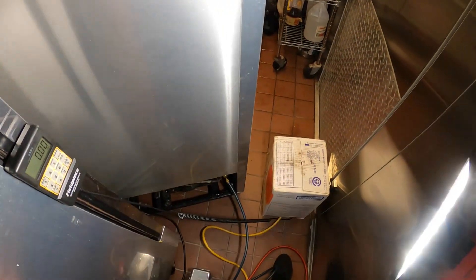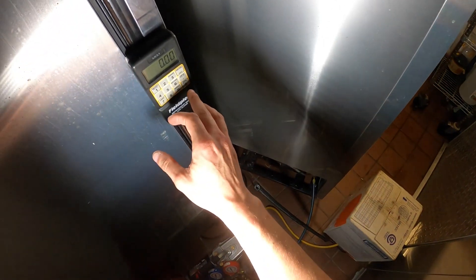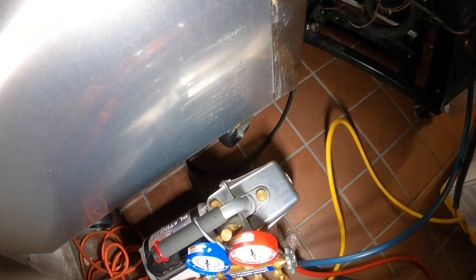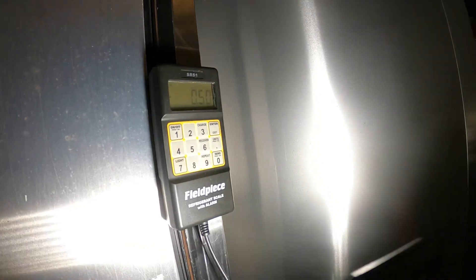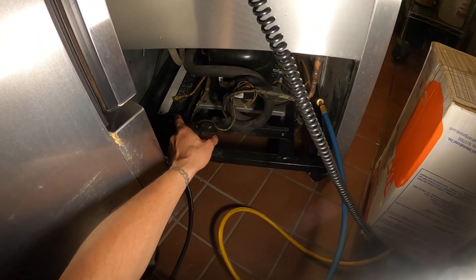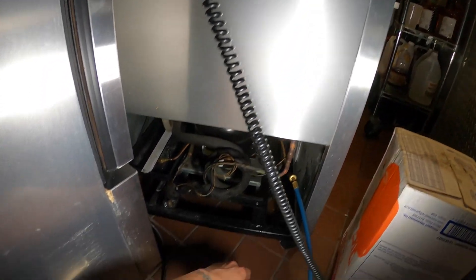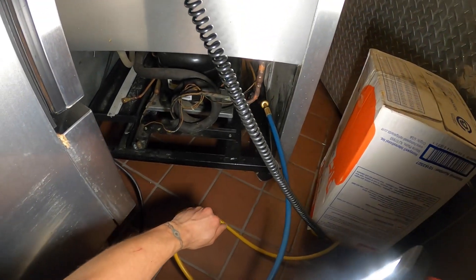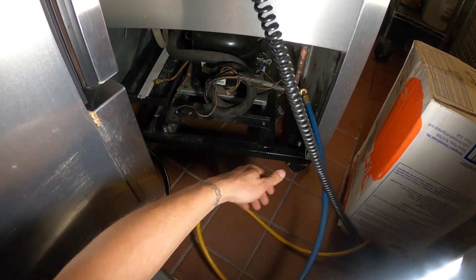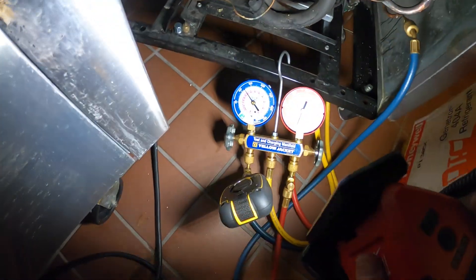We're at 751 microns. We're going to close this and make sure the vacuum holds, and from there we're going to charge up this system. We're done with the vacuum — everything looking pretty decent. This is refrigerant 404A. I looked at the unit tag and it takes 10 ounces — this is a critical charge. I already purged the air out of the hoses. On the blue hose I'm going to open it up and watch the ounces. You need 10 ounces, but I brazed in two ports and pulled a vacuum from both. In the end I closed the high side and kept one hose on here, because with such a critical charge, when you take off the hose you're going to lose that perfect charge. So we have to add a little bit extra — a little more than 10 ounces — so that when you take off the hoses there will be a full 10 ounces inside. It's a bit of a guessing game, but I'm going to make this work.